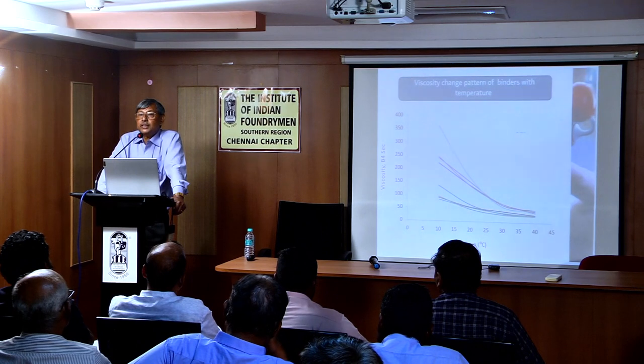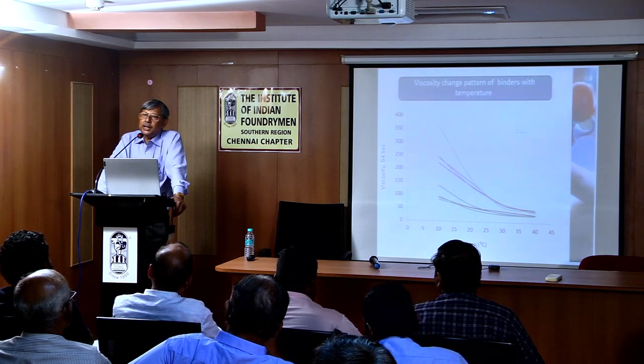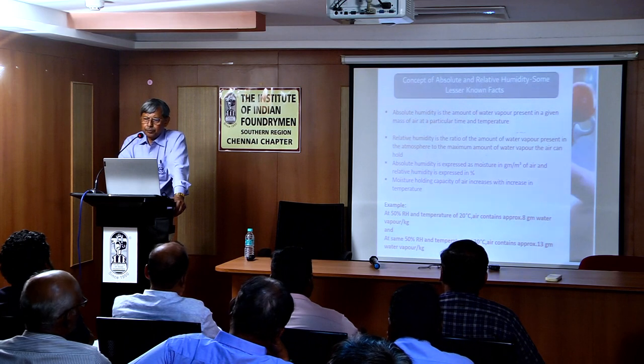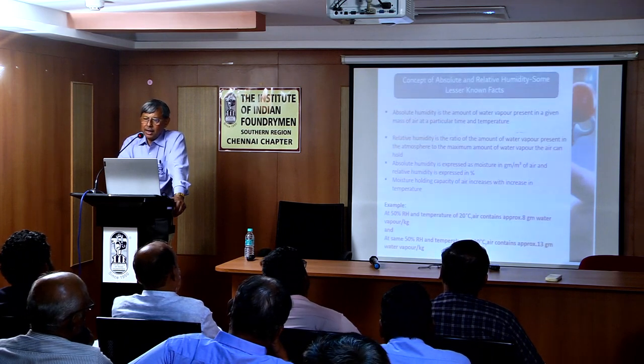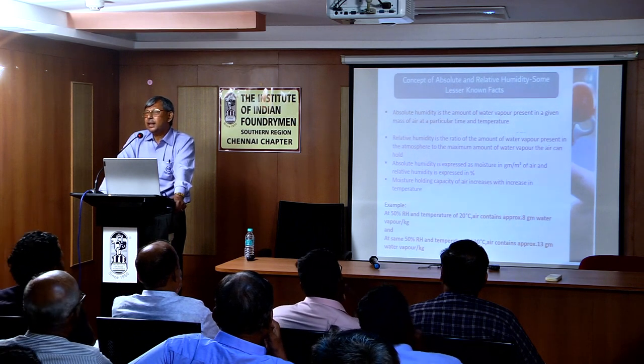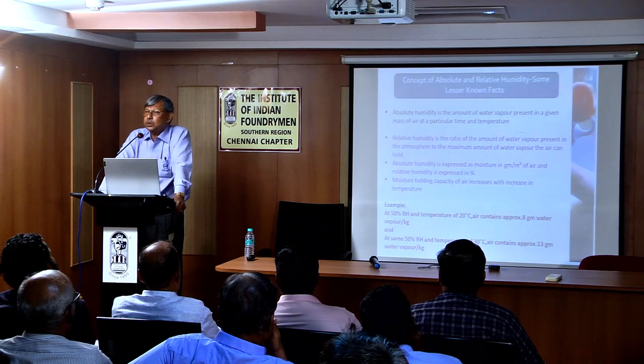The resin and solvent separate because of immiscibility. That should be avoided, and any time it happens, the sand is not usable. So this is all about your humidity and your temperature. Now comes the humidity.